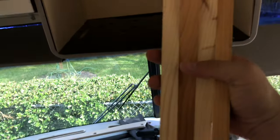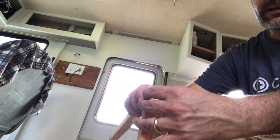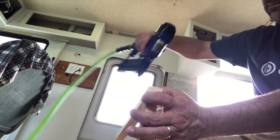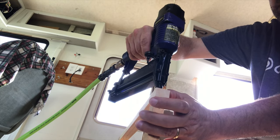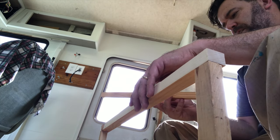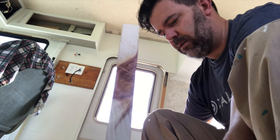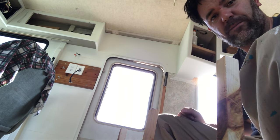I'm going to cut more door skin and just nail it right up into those so I've got a nice solid cube in there, which will cover up that hideous ugly TV compartment and turn it into something useful. I'm using a nail gun and these little guys. I've already done the first one and now I'm lining up the second — just pop in two nails, because if you do one this thing may flip around. We're going to put one also in the middle, flip her, and do the same thing on the other side. Now we've got ourselves a little skeleton.